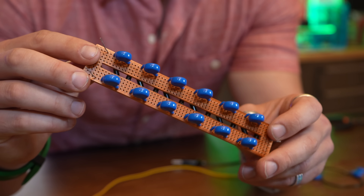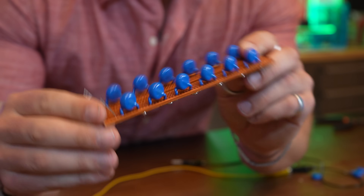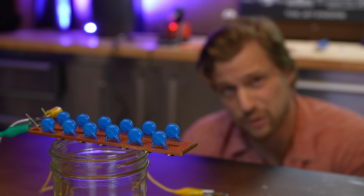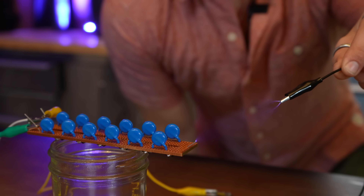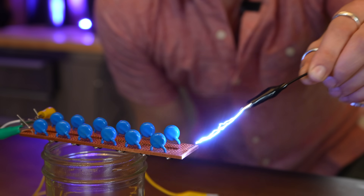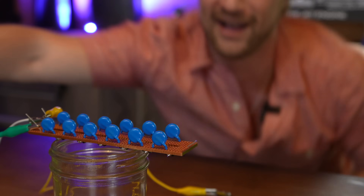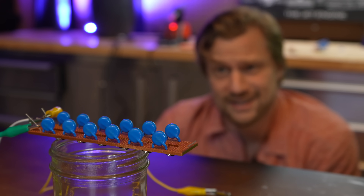Here's the first half-wave multiplier. Designed to fit into the casing, it can accept up to 15 kilovolt input and should produce over 120,000 volts. Now I've got a six-stage half-wave multiplier — will it perform better than a full wave? I am prepared to find out. That's two two-and-a-half-inch arcs, and it's not even encased in resin yet. This is going to be epic. The results were super clear: a half-wave version is going to work so much better for this project than a full-wave version.